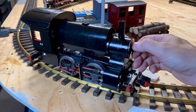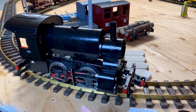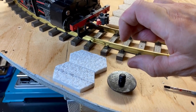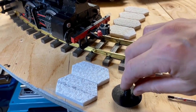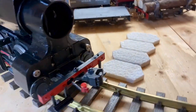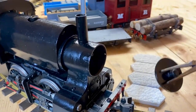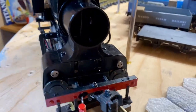One of the added benefits is this piece, which was held in with two little screws on each side. In its original RC configuration there's a button you press and in here was a sparker that lit the flame. What I did was take a regular bolt, cut the head off it, and just use nuts and the knurled piece. Now I can get in there and light it up — see, that's fine — and pop that back on. Now I can actually see the firebox, which I couldn't before — that was a flaw in the original design.